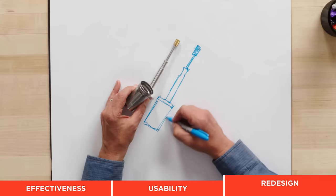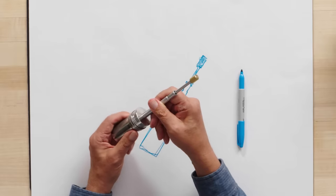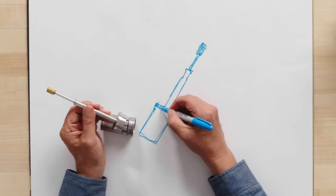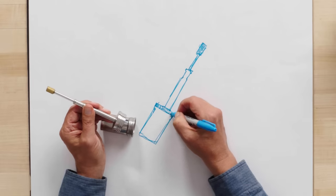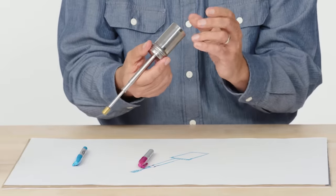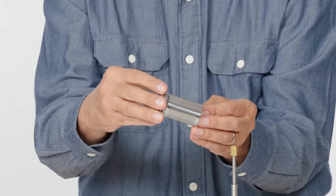Let's talk about a redesign of the Final Press. It was difficult to actually unscrew this, and it's also difficult to see where the two halves separate. So I would consider whether or not this top half can be colored or knurled — do something to help differentiate it. Knurling it, even if it's just slight, would make it really obvious that this part and this part are different. The other thing is once it gets tight it doesn't want to open up, so knurling on here may be the way to go. There's not much else to do to this really — I would leave it as it is. It's very impressive how fine this screen is, and I think that's a big benefit over some other alternatives.